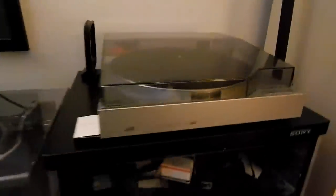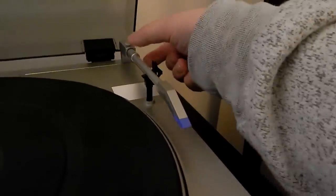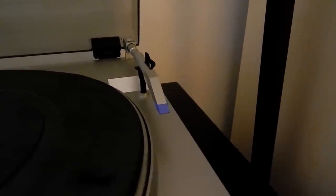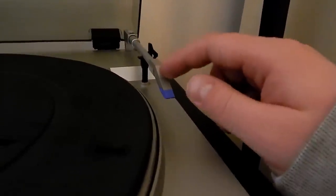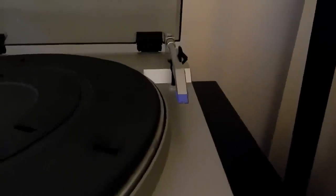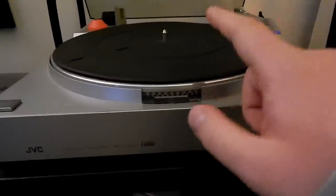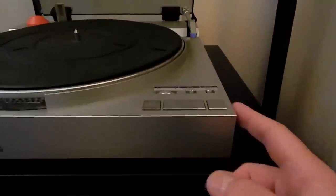At the same time, I do love this JVC turntable, but the situation with the cartridge and stylus is a little proprietary. You can change tone arms, but it's a proprietary tone arm and a proprietary stylus to this cartridge, meaning there are no aftermarket styli that are elliptical or otherwise — all you can get is conical. So you end up getting more sibilance than necessary, and I can hear it in my records on this particular table. The Achilles heel is the stylus, really.